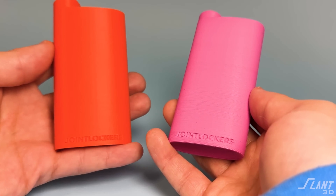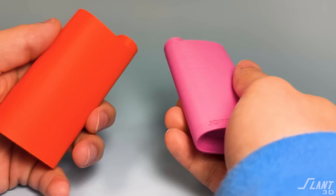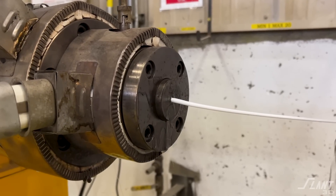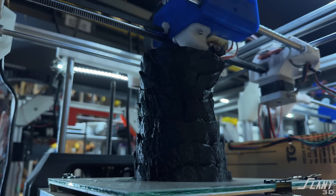We were not allowed to use textures or add draft angles — this was a very strictly designed part. Because of how tightly packed it was, there was not a lot of room to move within the thin walls. We ended up iterating through almost a hundred different iterations for this single part to get to a stable, reliable production file that worked across multiple colors. Lighter colors generally tend to have a lot of titanium dioxide in them, making them behave more like toothpaste. Darker, deeper-hued colors have less titanium dioxide, so they flow smoother and are easier to control.